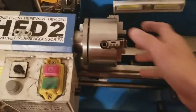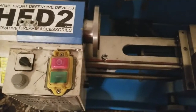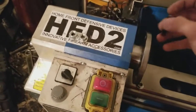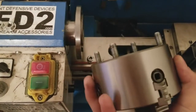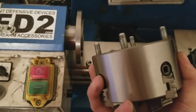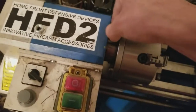Today we're going to be talking about the four jaw 4-inch independent chuck. If you went out and bought one, here's a couple things to keep in mind. Mine comes with screws, but there's no way you'd be able to get the screws back there to put it on. So what I did is went to Home Depot, bought two and a half inch screws, cut the heads off, put them all the way down, and used red Loctite to lock them in place so they won't come out.